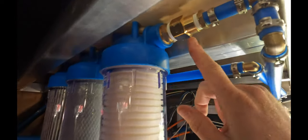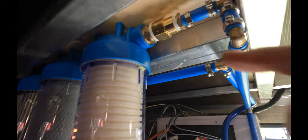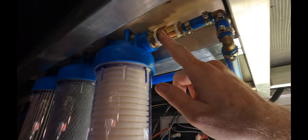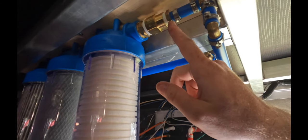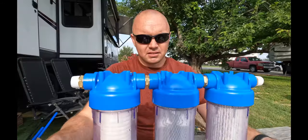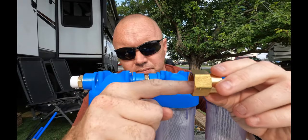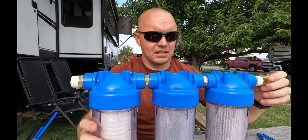When we had it hooked up outside we had a hose adapter. What we ended up doing is taking that off and getting a reducer that went from three-quarter down to half-inch, then screwing in a PEX adapter. I'll throw in some clips here — we did that on both sides.